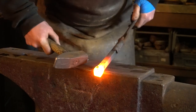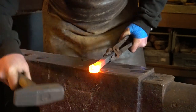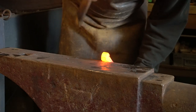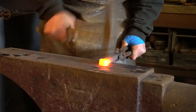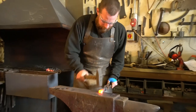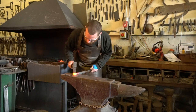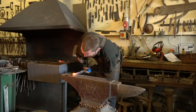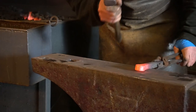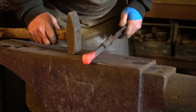You don't want to be cutting into the bar — we're trying to round up what we've got, not forge it down. And you can do it on this side as well; it doesn't really matter which side of the anvil you work on so long as it gets the job done. What we should end up with is that sort of classic British stop sign — that octagon on the end of our bar. Tidy up the shoulders again a little. This is where having a square-faced hammer really comes in handy, because you've got a nice flat end of the hammer that you can get in that corner with. A little bit more awkward with a round-faced hammer, but you can do it — nothing's impossible.